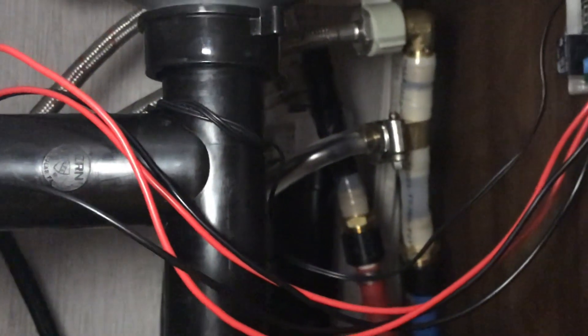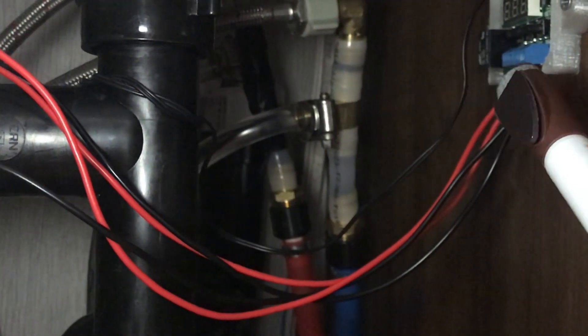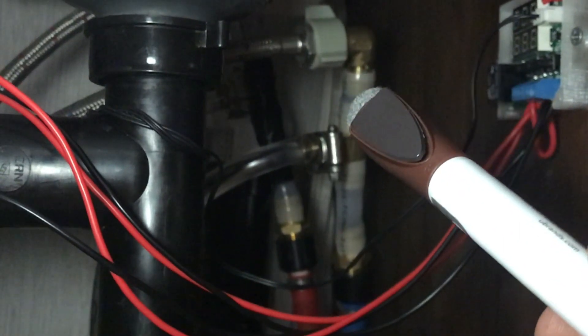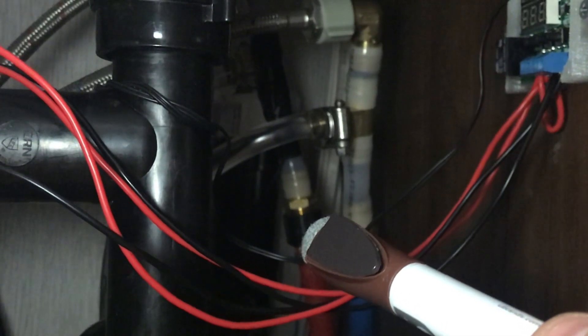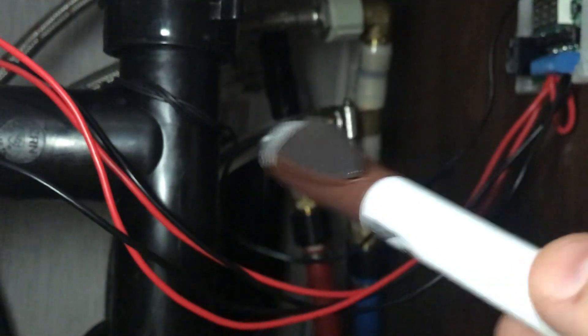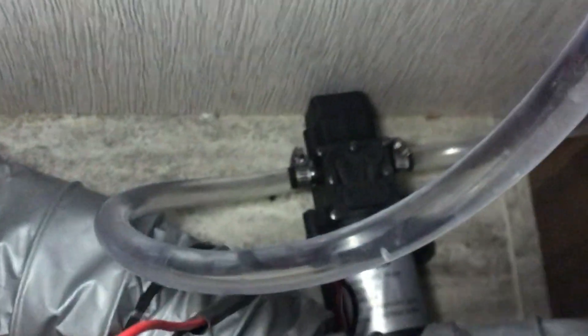Looking underneath the sink — here is my temperature control sensor. It's just 12 volts in, then a relay circuit, and a little temperature probe that goes over to one of the brass fittings. I disconnected the fitting for the sink right here, added a quick adapter with a T, put another adapter on the other side, and rejoined it. It's just a T off, and these vinyl tubes go down to a small pump sitting right here.